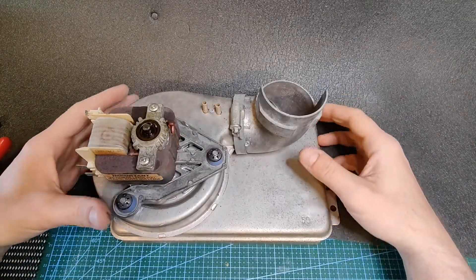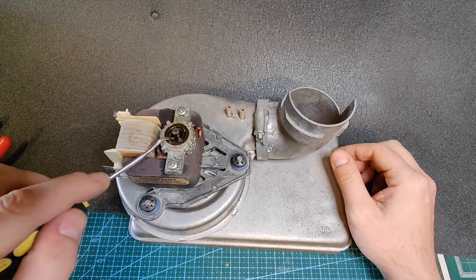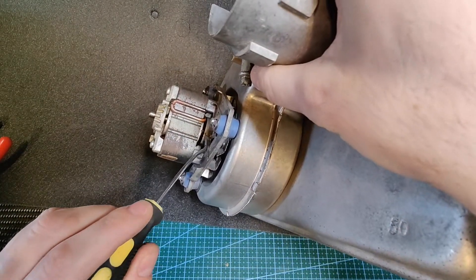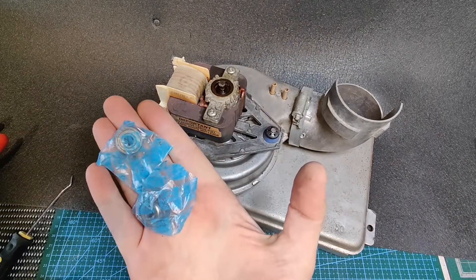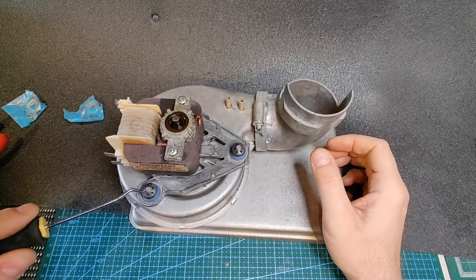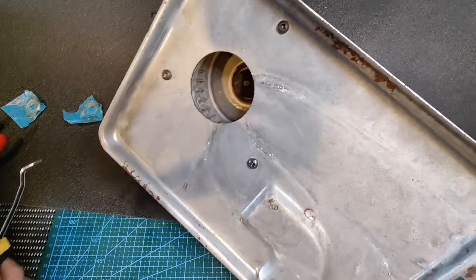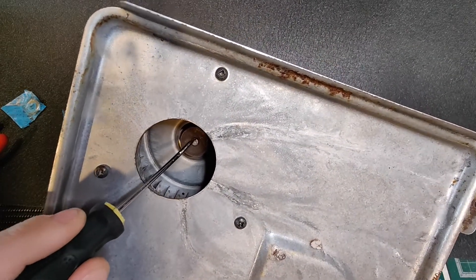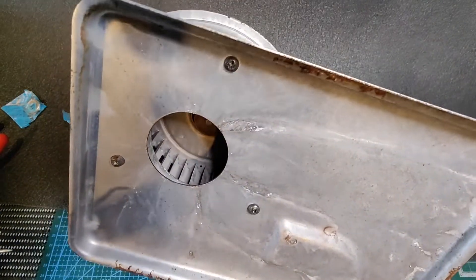I have the fan out now and on the workbench. The aim here is to take this bearing and the one on the opposite side and replace them with these two MTK bearings that I got. What we're going to have to do is take off these spring clips and this cap that's on the top of this bearing. We might have to remove the screws that mount the plate to the bearing housing because we're probably going to have to knock the shaft out through the top bearing.